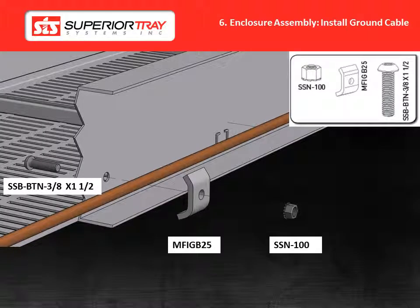Install the ground clamp by drilling a 7-16 inch hole in the tray, and install the bolt and ground clamp as per the image on the screen. Please note that we will talk about terminating the ground cable in the installation for the seals. However, it is important to know that the hole must be drilled in the stubs, in the trays at 10 foot intervals, and at each fitting prior to pulling the cables. Every part on the cable bus should have a ground clamp installed. Please note that the ground clamp and bolt part number may change depending on what size of ground cable is supplied.